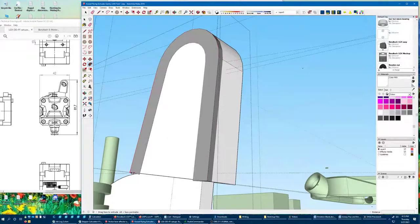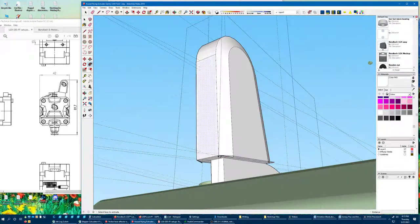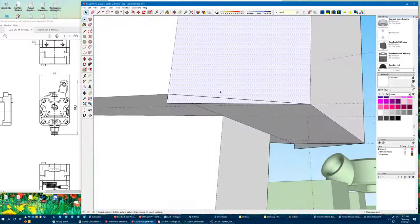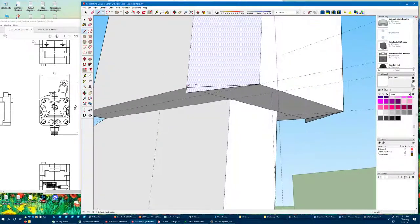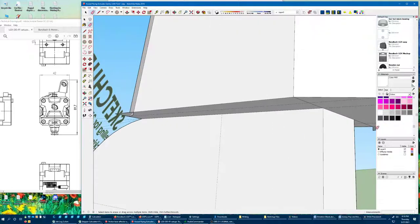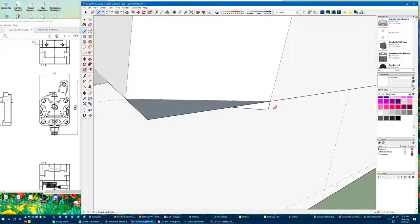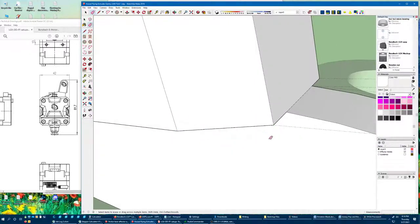Just throw little corners on that. Use the follow me tool — run that up and around. The follow me tool tends to get weird around ends, but I will show you how to fix that. Now we've got problematic geometry — the end bit there extends back, and we've lost our solidity. But SketchUp thinks this is a line not really associated with this plane. If we draw it, it becomes unhighlighted — so that means it's not an edge edge anymore. Just gotta do that, and over here SketchUp actually didn't make that line in the first place, so just gotta draw it. Make sure there's no hole — all good.